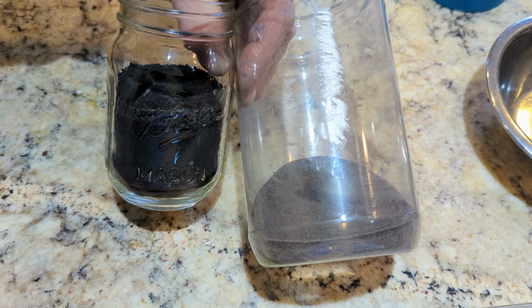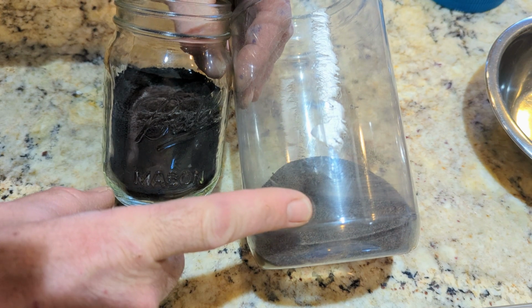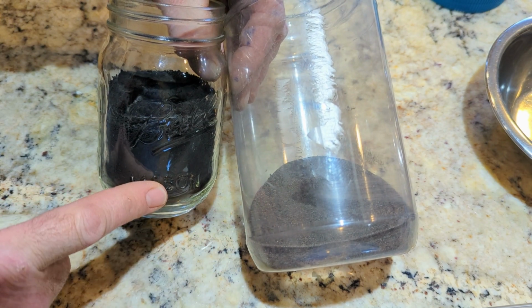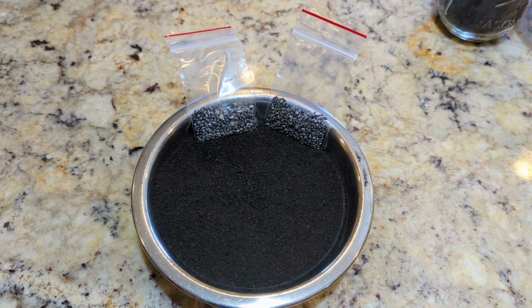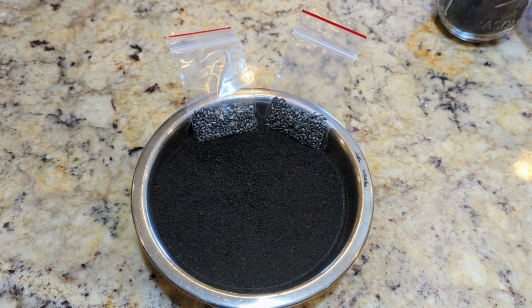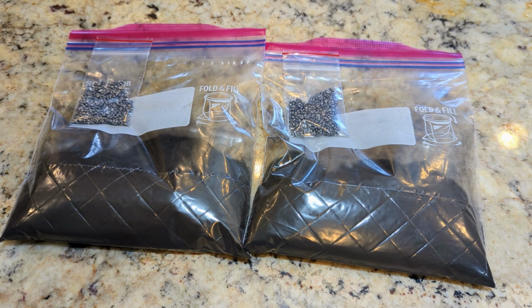Perfect. Step number 3. Smelting chemistry. For every 1 scoop of the concentrates, I will use 1 scoop of the Hank Chapman flux. After mixing the flux with the concentrates, there is too much for 1 smelt, so I weighed out another 36 grams of bismuth, and I will separate this into 2 equal portions with 2 equal portions of a collector metal. Hopefully, if this works out, I'll be able to complete 2 cupel processes in 2 cupel dishes and have 2 precious metal beads.